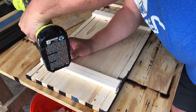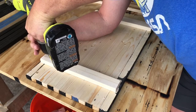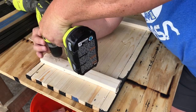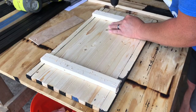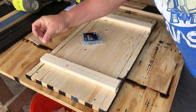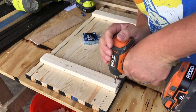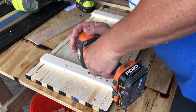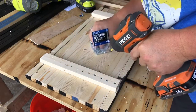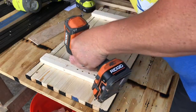I'm going to use a tiny 1/8-inch drill bit, just enough to get a pilot hole going because I don't want to split the wood when we put a screw in. I'm going to put some one-inch wood screws in here — just enough bite to grab into these cross pieces and make sure they don't go anywhere. This is a little extra work, but it makes sure that when this thing goes up, it's not coming down on anybody's head. Just a little extra effort — doesn't hurt.